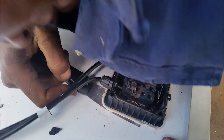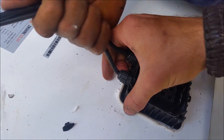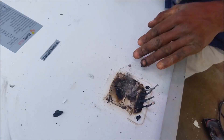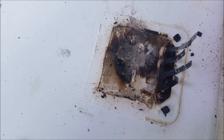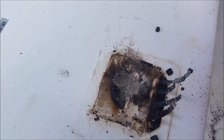Gently and with a lot of pressure you can actually just lift it out. And as you can see, that is lightning damage. Now I'm going to clean the panel and replace it with the new one. You have to clean the panel to remove all the old silicone and that kind of stuff.